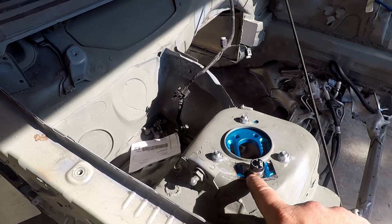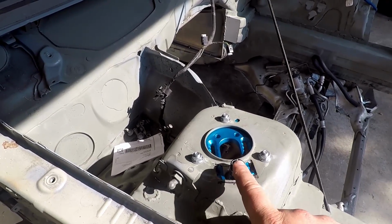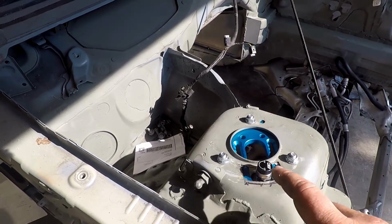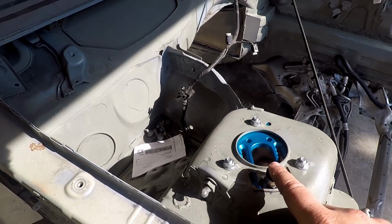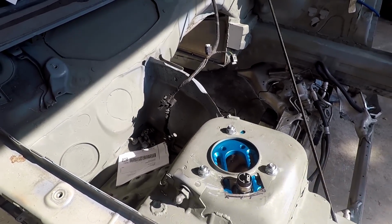I had to turn the top nuts down on the BC Racing coilovers to be able to fit the adjuster through the Wisefab top hat. So if you do BCs with Wisefab, just know the adjuster won't fit anymore, but you can turn down the little shoulder nut and thread it on there.